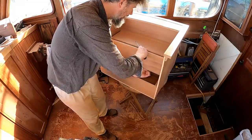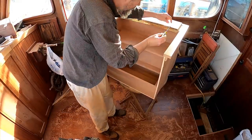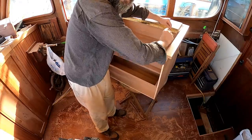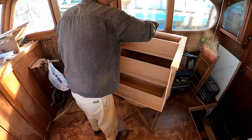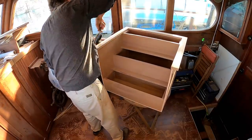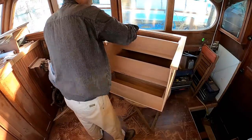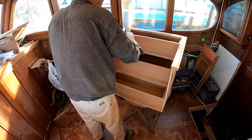So it's the final tidy up sanding on these components. And you know what's after that? Good old tung oil. As I've said before, one of the most wonderful things about tung oil as a first finish is its tolerance to dust. It basically turns your cloth into a tack rag because it's an oil. It basically doesn't mind getting all oily.